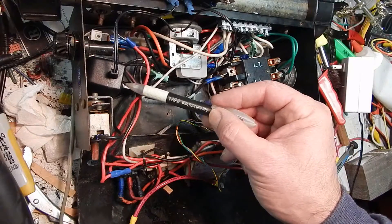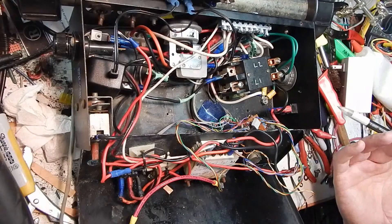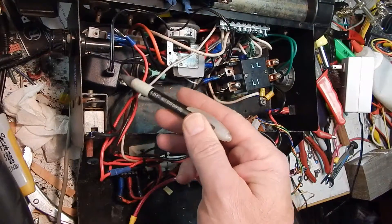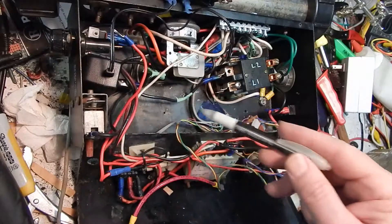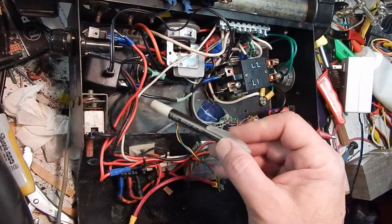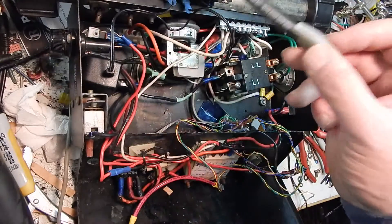This here is actually a 12-volt little power pack. I found my little 12-volt brick I used to use along with this project, but it's fried. So I stashed a little tiny 12-volt switching power supply — it's actually 1-amp rated — right into the unit, which allows me to use the old relay's 120-volt relay contact power to drive this power supply, and this is going to drive the new relays.